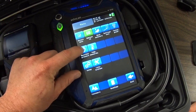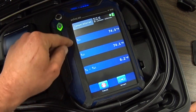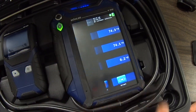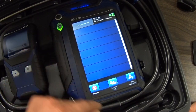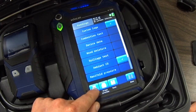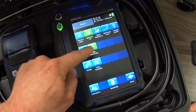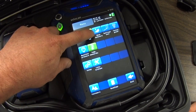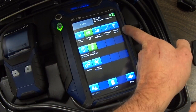You can take your manifold pressure and your temperature measurement, and it will show you a delta T between stack temperature and ambient. You can accept that and save that. Go back to menu and we've turned our temperature measurement green. You can take a wood moisture reading with an additional accessory, and then you can use the tuning guide as well.